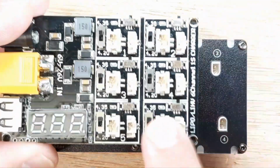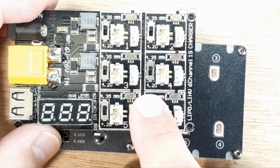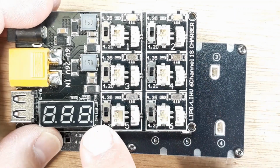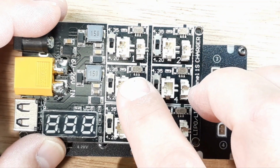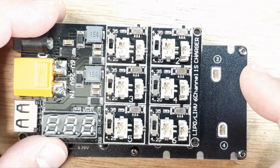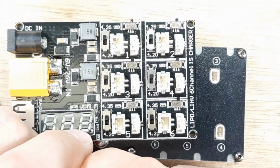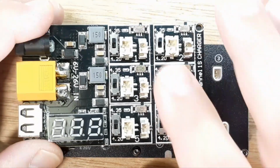Currently, the 3 charging boards that I'm using, they're very much like this one. They've either burnt out, like one of the cells is burnt out, or they over or undercharge. I've had some come off at 4.41. I've had them come off at 4.17. It's just very non-consistent. And then of course storage charging is kind of a bear because you plug it in, this reads out incorrectly, so you unplug it, you plug it into your checker, and you've got to plug it back in, and eventually you get the storage charge. So it's kind of a pain.